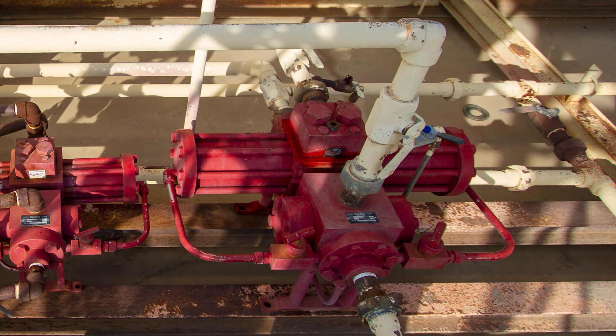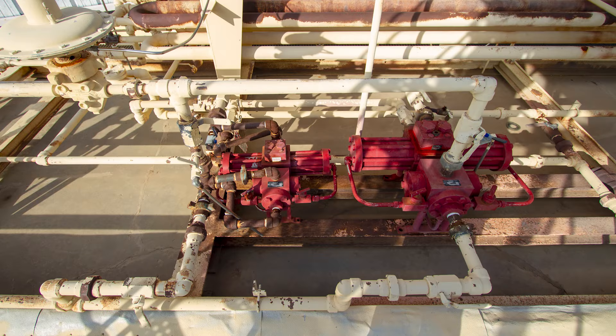This particular glycol pump is set at the lower end of its stroke rate, probably below the recommended stall rate. However, the customer system is clean and good enough to allow the pump to stroke and maintain the dew point required for the pipeline. The producer also has a unique setup where there is a 210 pump that runs during the summer months when there is less gas flowing and the smaller pump can handle the flow.